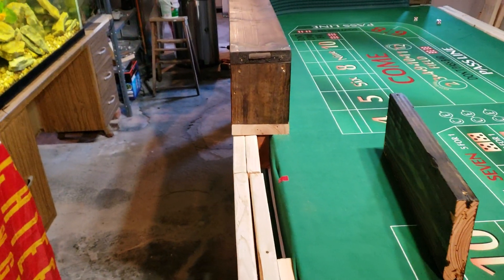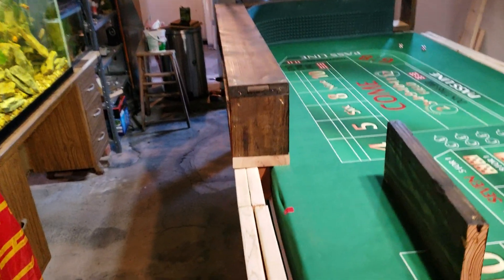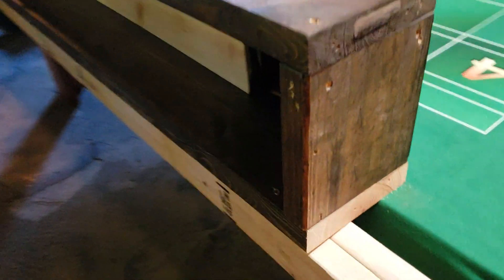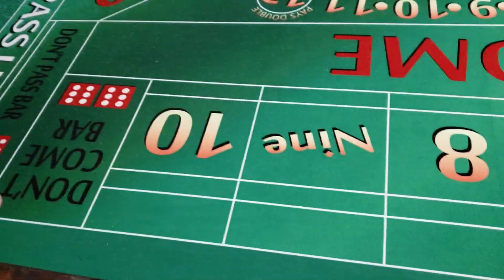Now you can see how it sits on my cleat along the side of the table, and then I screw it down from the inside here. I just drive screws down in, and they come through my top, my rails, down. It's nice and sturdy too, folks.